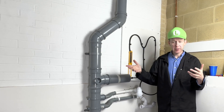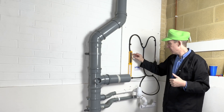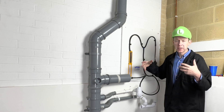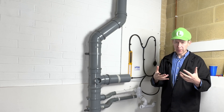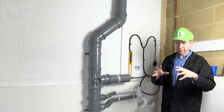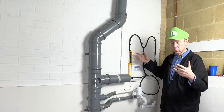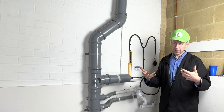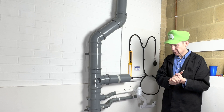Just while we're waiting for the test period, a few things to be mindful of. This is 38 millimetre water gauge. Some students mistakenly call it 38 millimetre millibar — that's completely wrong. Don't use millibar. It's 38 millimetre water gauge. Just for the record, 38 millimetre water gauge is about 3.8 millibar.